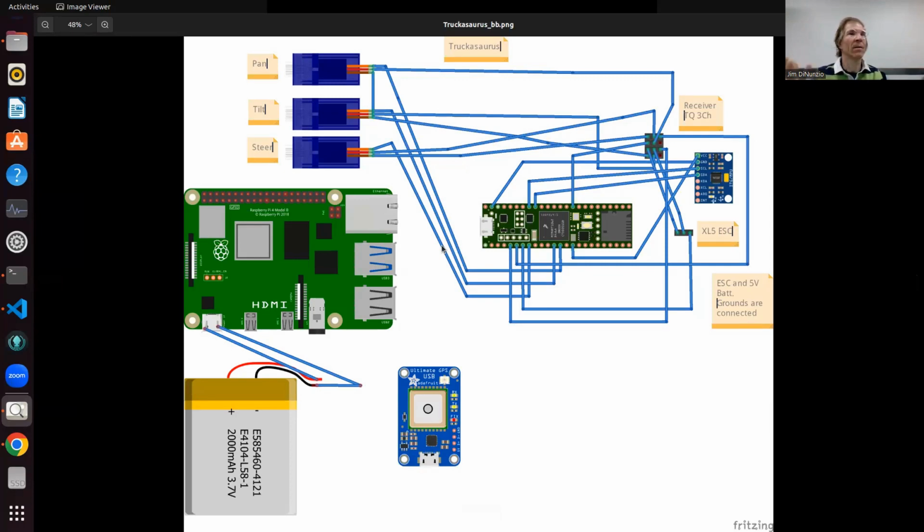I used the compass for that because I was having trouble getting the gyroscope working. They always have drift, and you're supposed to tune it and keep it stationary. I was in a hurry, and I didn't want to learn that. So I'm like, I'm just going to use the compass. I set it up with the compass, and I had the robot walk a straight line by checking the compass direction. So it does work, but it's subject to all the magnetic problems that you get with a magnetometer. But I put it on a wood table, away from everything, and it was able to do something reasonable, walk that straight line, and it would stop, take a measurement and turn. But I'm putting it in here for the ROS implementation of micro-ROS, which is what I'm running on here now. I won't talk too much about that.